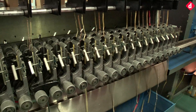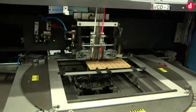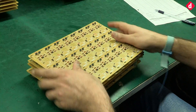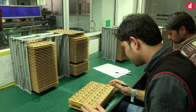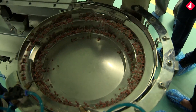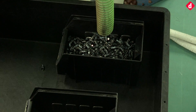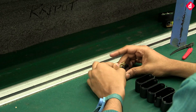The components for the chargers are made as per the design requirements. The internals of a charger are made up of multiple components that Intex manufactures themselves. After the components are made, they are put on the board in a machine — the specifications of the charger are fed in and it places the components including diodes, resistors and other parts. Some components are placed mechanically and some manually. The charger board goes through a manual inspection to check if all parts are in place. Ceramic capacitors are cut as per specifications; the smaller capacitor is used for noise reduction to ensure the charger is quiet when charging your phone.